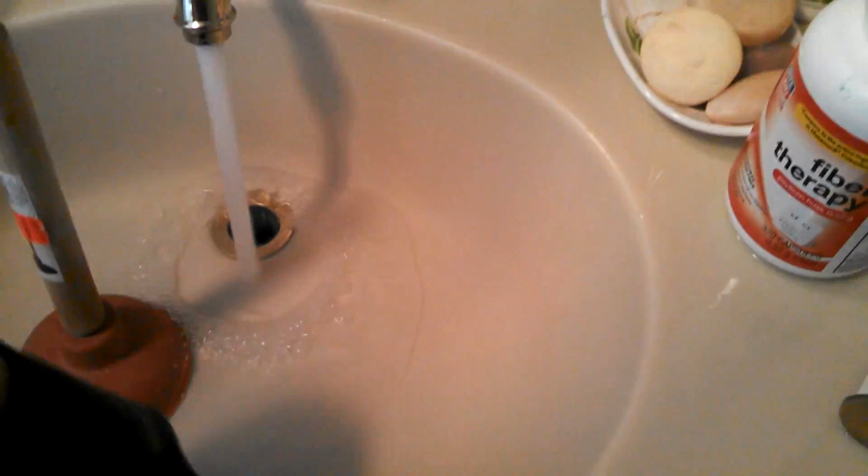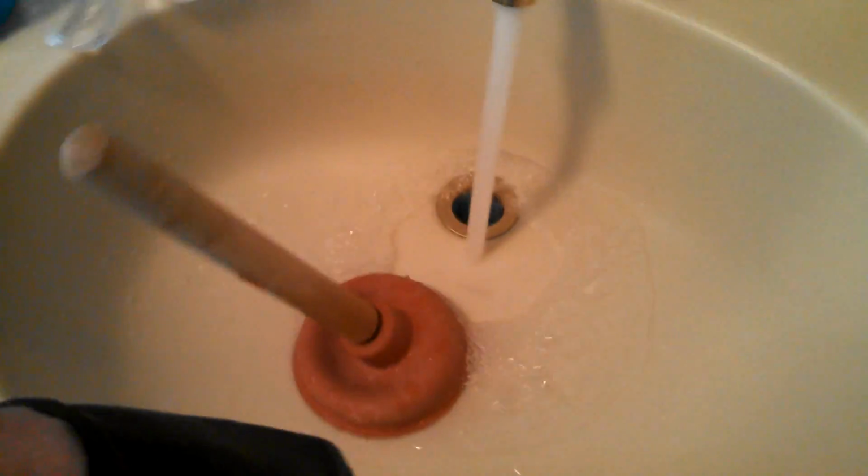Alright, I got the pop-up out because I was messing around the sink here a little bit. Oh, by the way, if you're going to plunge a sink, there's always a little hole here. You have to cover that hole or your plunger is ineffective because that's an overflow. You can plunge all you want over here. The pressure you make is just going to come out here. So as you plunge it, one hand covers these little holes with a finger, or a wet rag if you have the 3 or 4 slot deal, and the other hand is plunging up and down like crazy, because plunging is not just a one-time deal, and the same with toilets. I got a video on my channel, I think it's called Toilet Plunging 101 or something like that, if you want to see how to plunge toilets the right way, the pro way. So there's a little tip for you on plunging sinks.